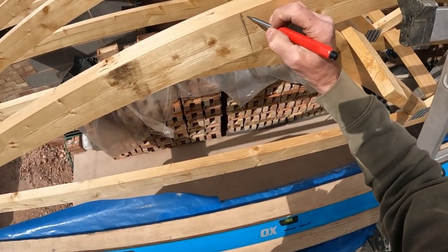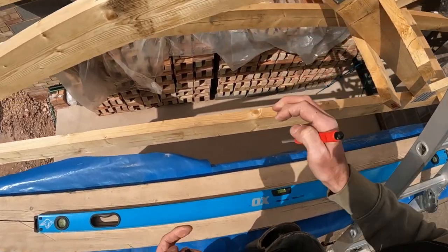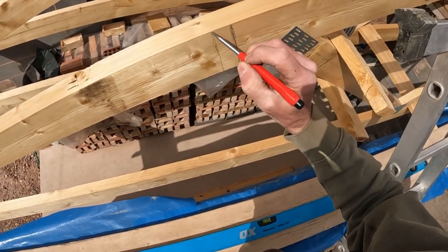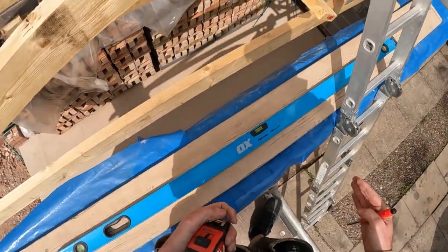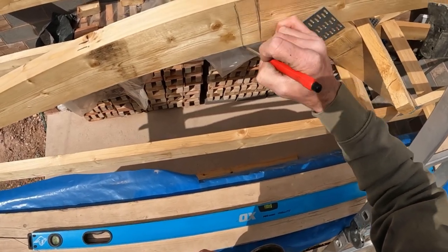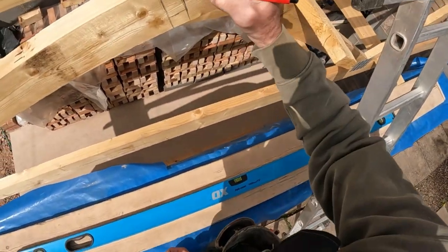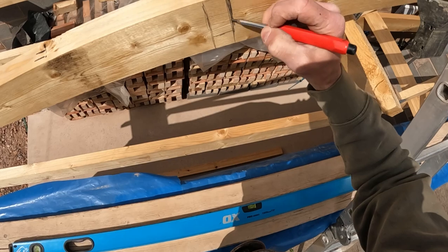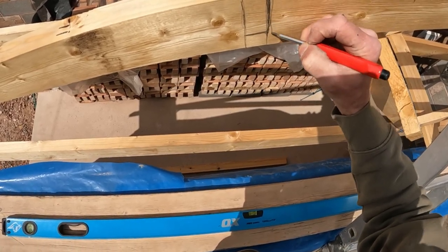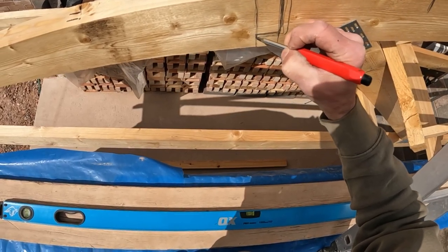When we put the capping board on, say if that's the brickwork coming up there now, I'm looking at it like this. That's the brickwork coming up there now, so it comes through and this noggin sticking out of the brickwork here. So what I want to do when I put the capping board on, so if that was my brickwork, and this is the noggin I'm going to put on, sticking out of this side, this gable. When we put the fascia on, we want to come down like that, and then the hockey stick of the fascia, we want to do that with it, so it returns into the brickwork, and then the round part of the fascia sits against the brickwork like that.